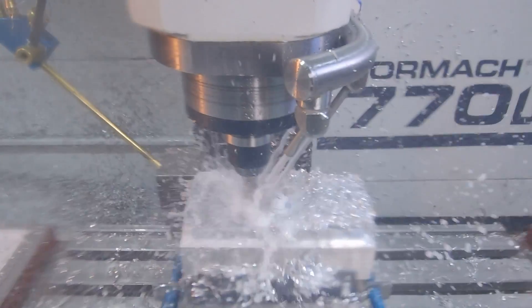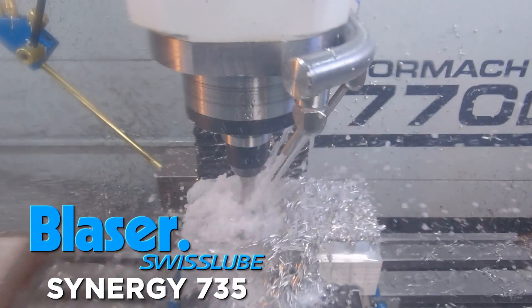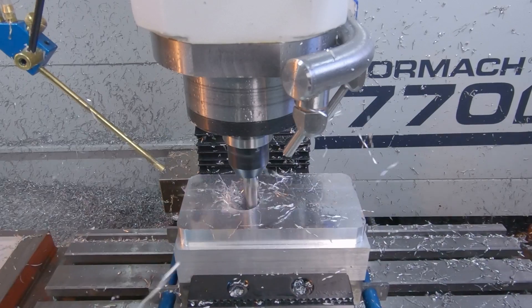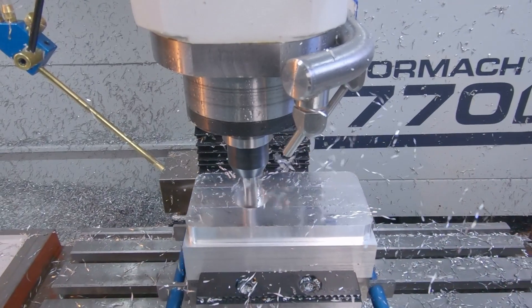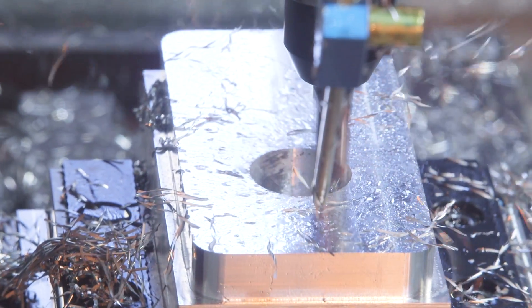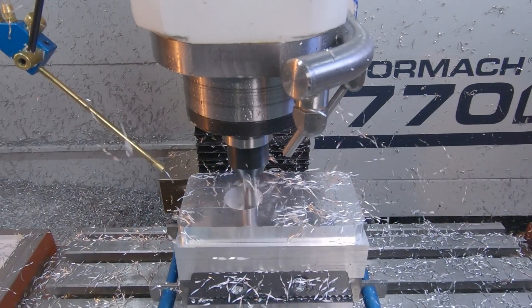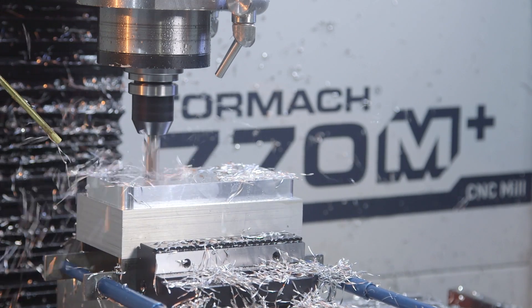You'll notice something — it's pretty clear, right? It's not that milky stuff you're used to. It's because we're actually using Synergy 735. Now that it's hit the bottom, it's going to start interpolating, meaning our radial 20 thou pass is going to come in and start taking those chips off. You'll notice that we're actually going to be dry running — I always highly recommend you use coolant when making your parts. We are only doing this for camera purposes so you can see those chips coming off.